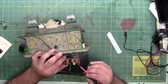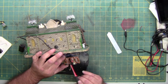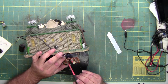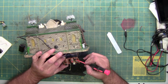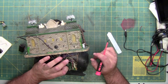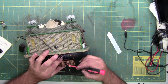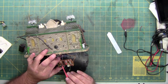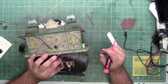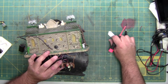Just desolder and re-solder — make sure you do it in the right direction or else they don't work. If you pop one of these resistors, this row they're all the same and this row they're all the same, so if you blow one you can match the color code from the ones above it. It's a very common setup on a lot of their non-animated, only-light-driven houses. You might come across a piece that has no animatronics and say 'this thing's popped — where do I find it?' Just look on eBay. For the color code, go on Google, type in 'resistor color code,' type in the color bars and it'll tell you the ohms and the percentage — one percent, five percent, two percent, ten percent.